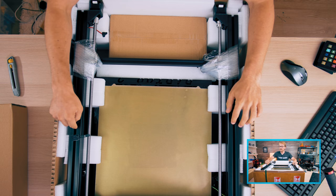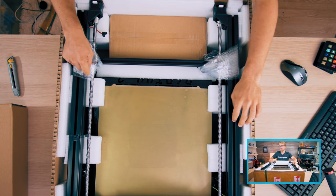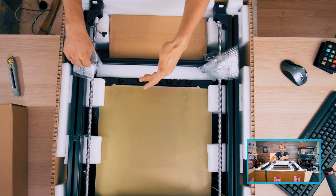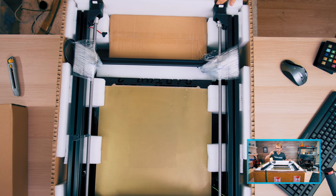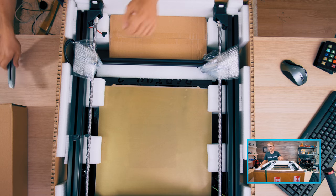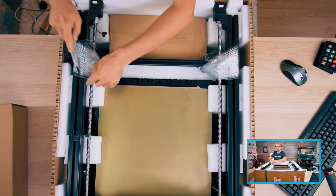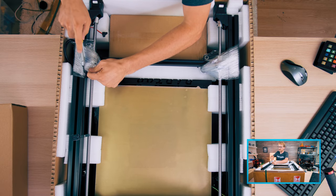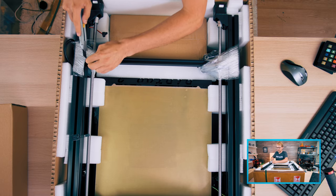This is big. So yes, one of the other features that I forgot to mention, it has lead screws. It has ball screws. There we go. It doesn't just have lead screws on the ZXs, it has actual ball screws, which are different to lead screws in the way that these are basically ball bearings. So they're very high efficiency and they're usually also made to a higher precision than just lead screws.